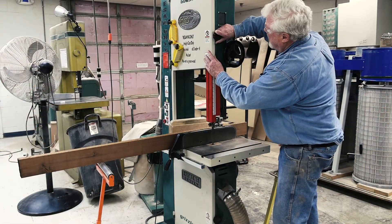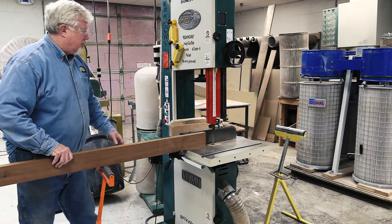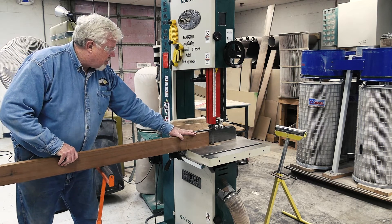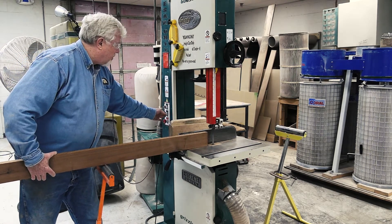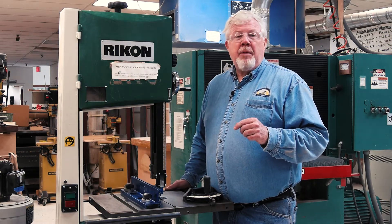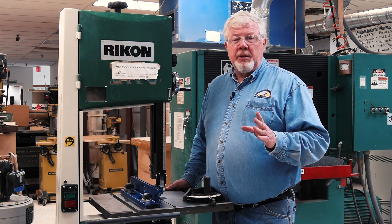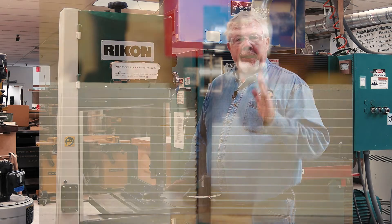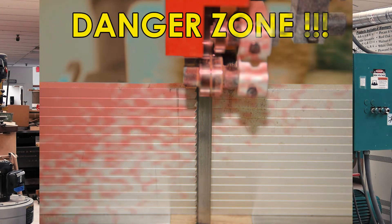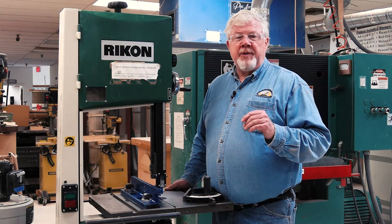To power up the bandsaw, ensure that all doors and covers are in place and latched. Then first turn on the dust collector attached to your saw, and once the dust collector is on, power up the bandsaw, making sure that there are no objects touching the mounted blade. Make sure that the equipment has reached full speed before you approach the machine to begin cutting your material. Also remember the three-inch rule always applies — that is a three-inch buffer on all sides of the blade. Your fingers, hands, and other body parts should never be allowed to come closer than three inches from a moving part of the machine.